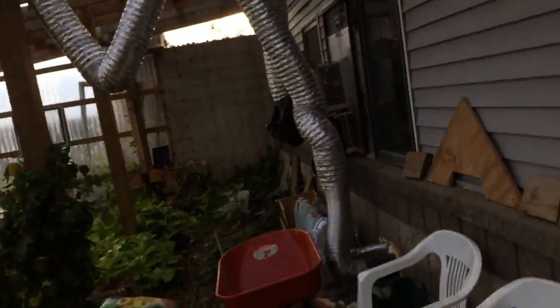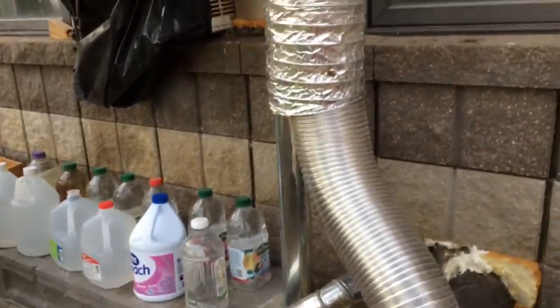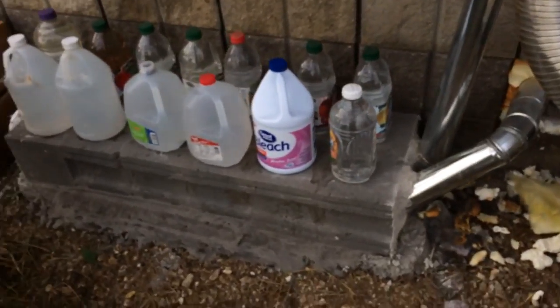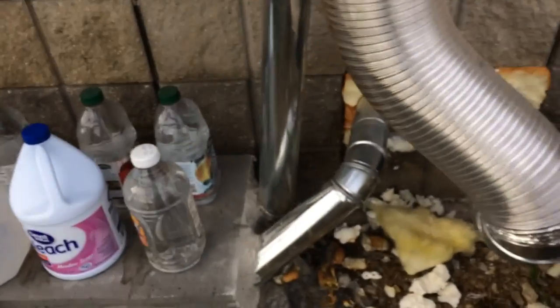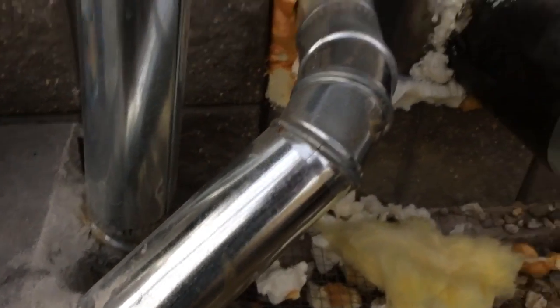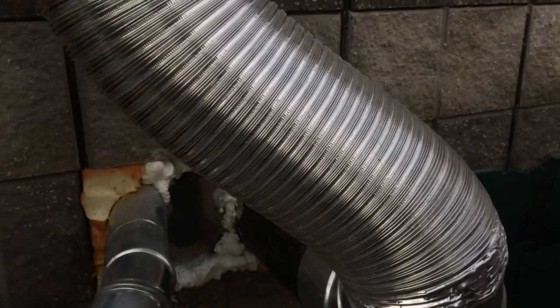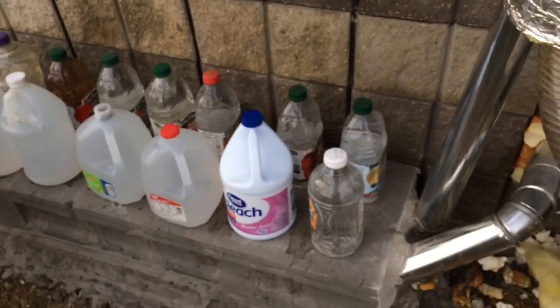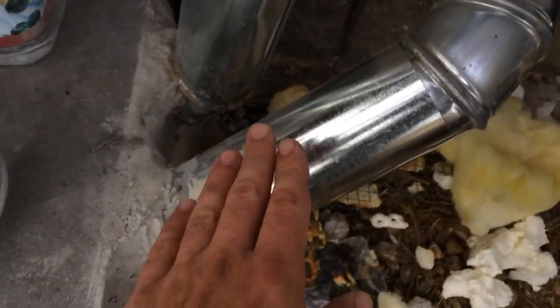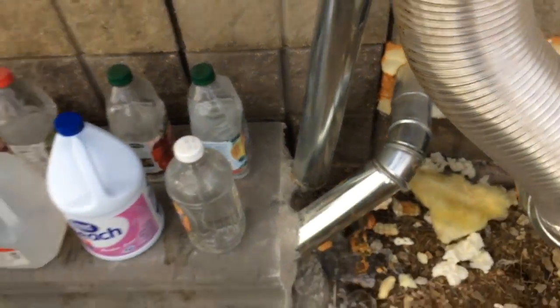Here's my tea tree — it needs to grow up some. Here's the rocket mass heater exhaust. I don't think I've done a video to show my exhaust out here. We got about six cinder blocks here and I ran this small exhaust. I showed this plan last year, running the small exhaust out this way, and the large exhaust already goes through the mass there inside the house. Then we got just a bunch of water jugs on top that's going to collect some of that heat. This exhaust here will burn your hands if you keep your hand on it, and right here it's cold, so I know that it's working.